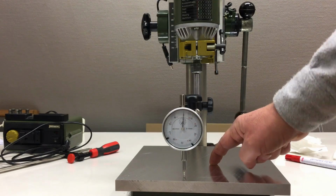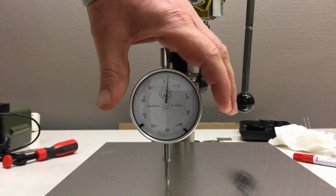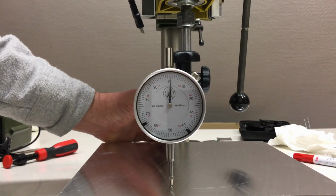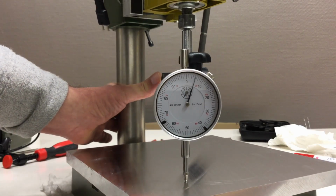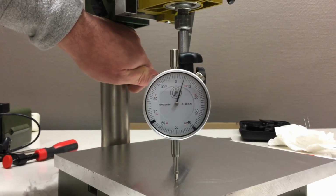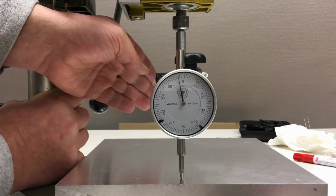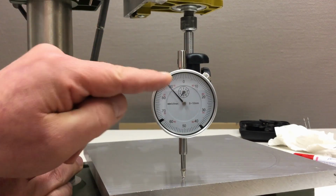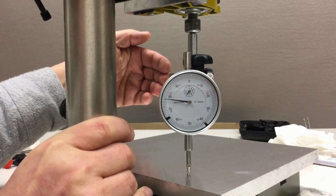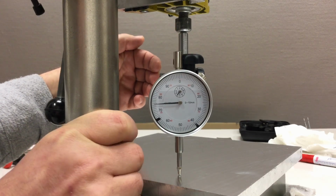Okay, let's start. This will be a little bit cumbersome, so we are now approximately at 0 at the front, and I'm trying to rotate now to the side, and I'm rotating with the spindle, okay? So the spindle is not locked. Oh, that's not too bad. Okay, now we're going to the back and it gets bad. You probably won't see it. Oh, 25 hundredths.